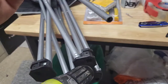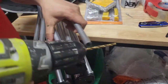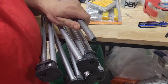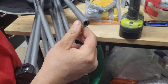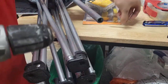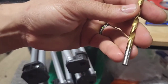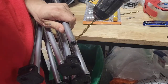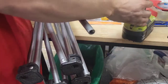I've got a — what is this — 3/16ths drill bit. We'll widen that hole out a little bit. Looks like I need to go the next size up, and it's okay to step up like that — it's actually better when you're drilling stuff out. So the next size up would be 13/64ths. There we go.